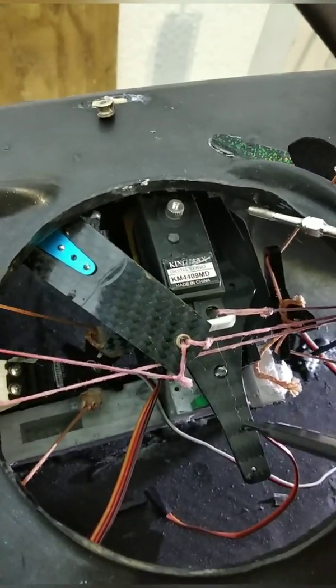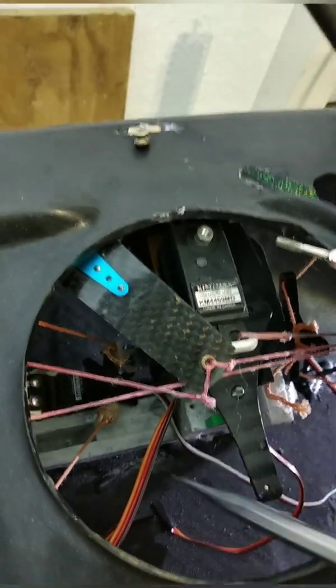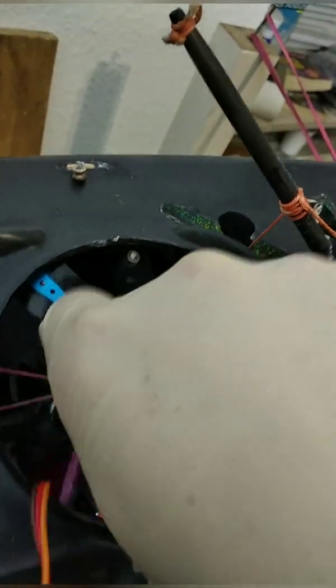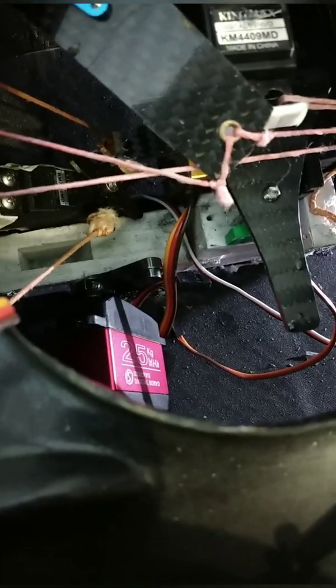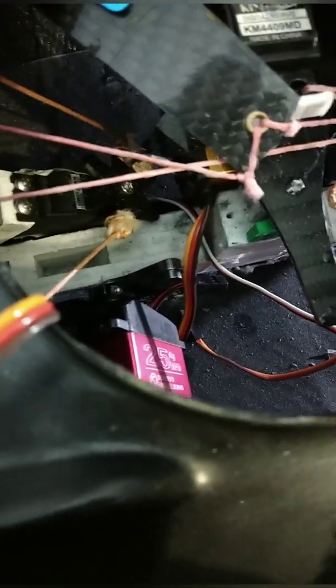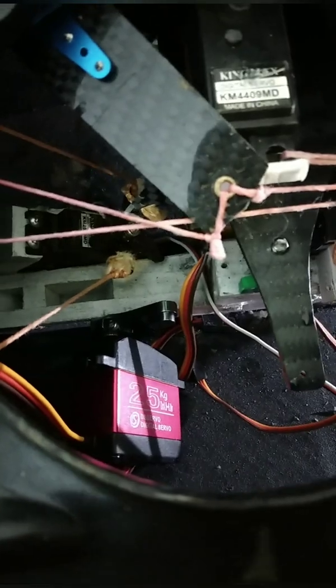We have some room left — we can either build a servo on top of this plate or chop the plate and build the servo down to the bottom of the boat. I thought I would use the servo positioned sideways with a longer end to adjust the sails. I will not use a sail winch because the servo is strong enough and much quicker than a sail winch, and also much less likely to clog up on the winch drums.